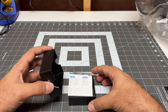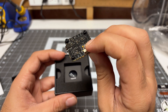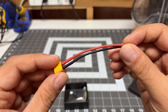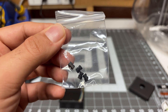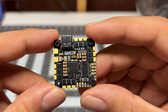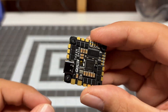Doing a quick unboxing, we've got some product literature — a colorful instruction manual. Next, we have the flight controller itself, and this thing is super tiny. And then finally, some accessories. First, we have an XT30 connector, and it comes with a very thin 18-gauge wire. Typically these have a 16-gauge, but I guess if you're going for super lightweight, this makes sense. We have a bag of extra gummies — nice to see. We've got a 35-volt 220 microfarad capacitor, and then finally we have two cable connections. I really can't believe how they made this so small. One of the components over here is actually hanging just a bit off the board. That is true commitment to compactness.